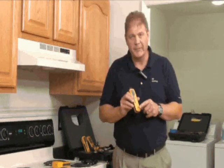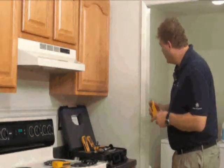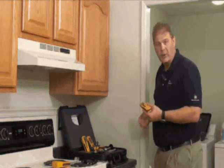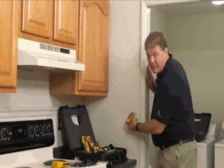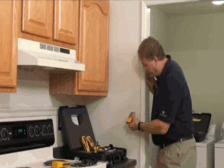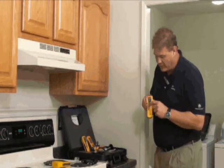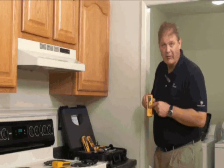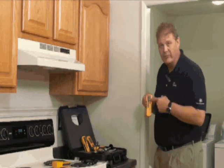This is a pin-type meter, so you can simply push the pins into materials. So let's look at this drywall here, but it could equally be a brick and plaster wall. When we use the meter here, it's important that you don't need to push the pins in deep into the material — just good firm contact to the surface is sufficient. And you can read out on the display the yellow, green and red showing the at-risk, dry and wet areas. So a very simple visual display.